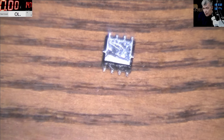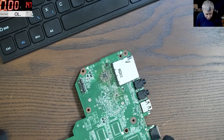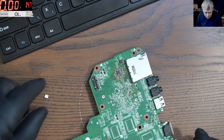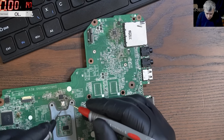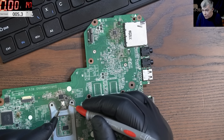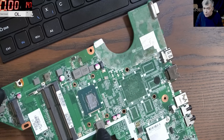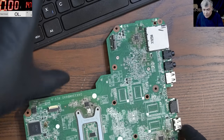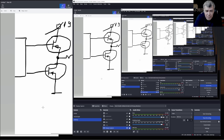So you took out the MOSFET, figured it out, seen this video, and you go back and check your board. A beginner will check the MOSFET, find the short, and replace it. But even after replacing the MOSFET, you go back to the board and still see a short - even without the MOSFET you will see 5.3 ohms here. Don't get me wrong - 5.3 ohms is far from being a short; it's actually a normal condition. This MOSFET and coil are part of the power supply providing Vcore to the processor.